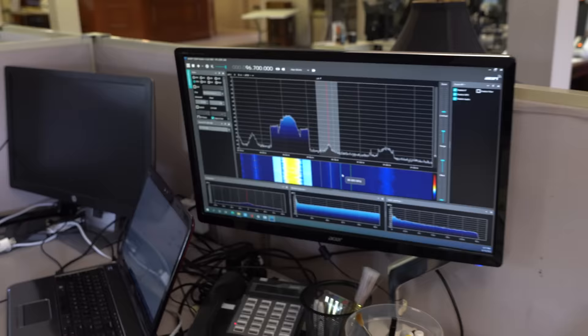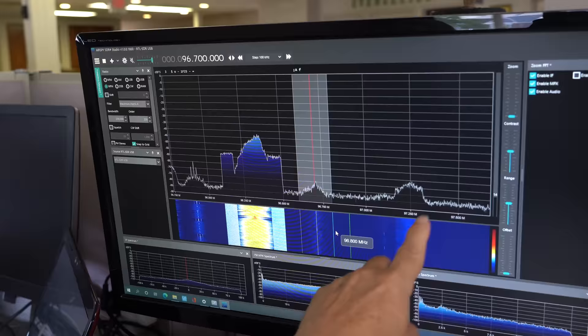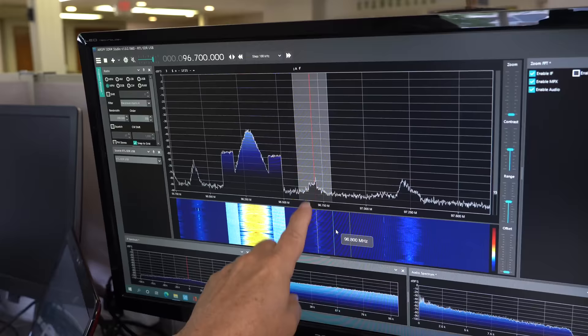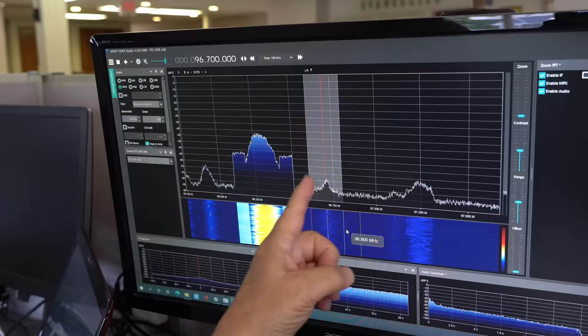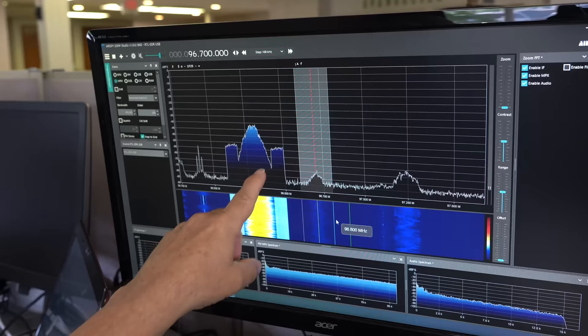Can you explain a little more about what we're seeing? This is the spectrum — you've got your RF frequencies down here, so there's a station at 96.3, I'm at 96.7 right here, and you can see all across the band. You can tune it just like a radio, but I'm seeing the energy at every moment in time and at every frequency. FM is frequency modulation — the frequency is actually swinging all over the place and jumping energy.